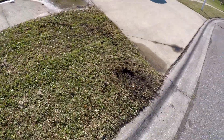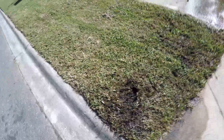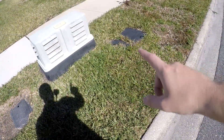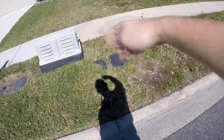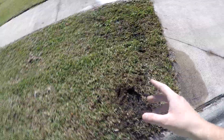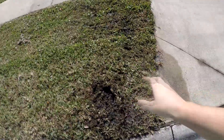We've got lots of leaking here all the way up the driveway, and it ends somewhere around here. The first weird thing is I'm not sure where the water box is. Normally there are water mains that look like this or this, and that's where the city shuts water off if you don't pay your bill or if you had a break between the city and your house. At least in our municipality, they carve letters into the sidewalk so you know where the water box is without having to see it, but there is no 'W' anywhere along here.